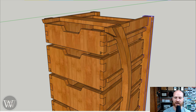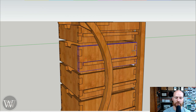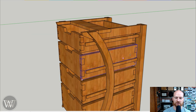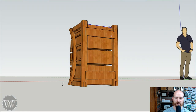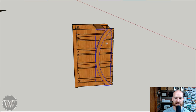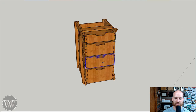These slides here are actually attached to the back leg and the front, so the drawers will run in and out on stopped grooves and the drawer will then be supported by it, so that way all the drawers can come out as far as they need to. I had a lot of people ask me about that — why they would just slide in. No, the slides actually stay put; the drawer slides in and out on there. All of the drawers are dovetailed together and the frame is a very basic open frame so you can see how it all comes together. It's relatively simple but designed to match the structure of the desk. I really like the open design — it will allow me to look inside and very quickly identify what's in them.